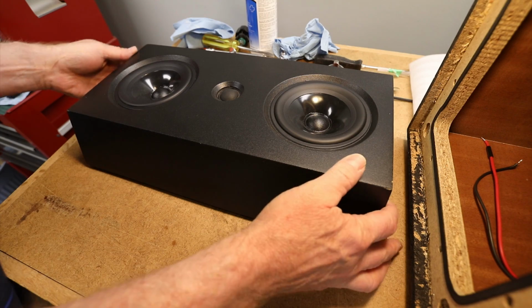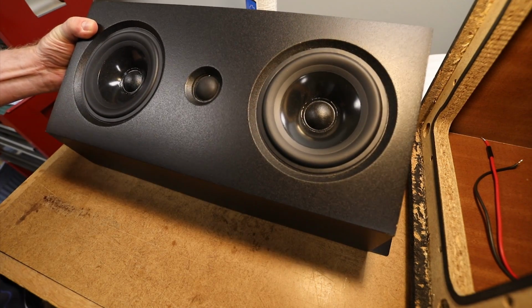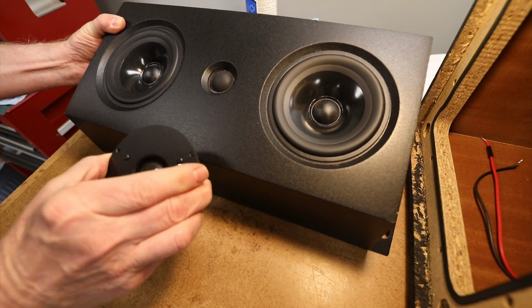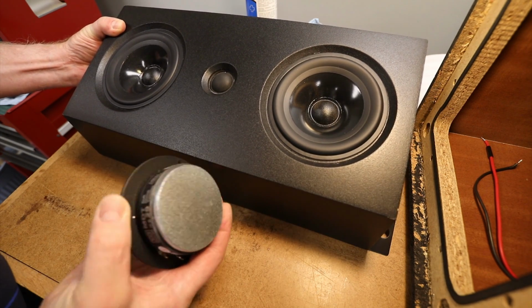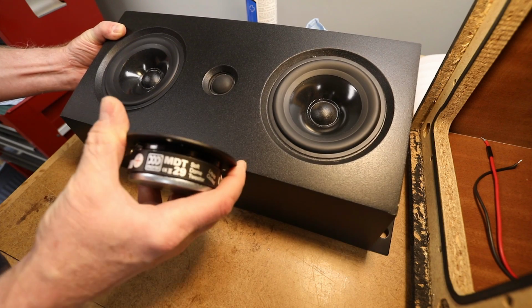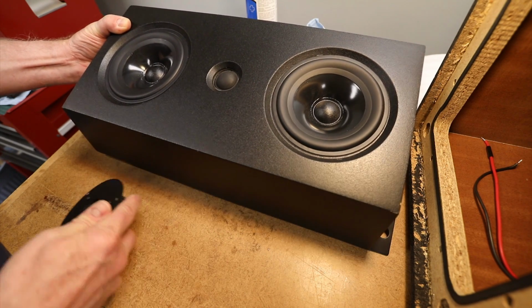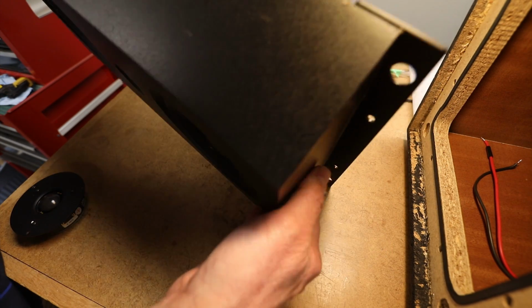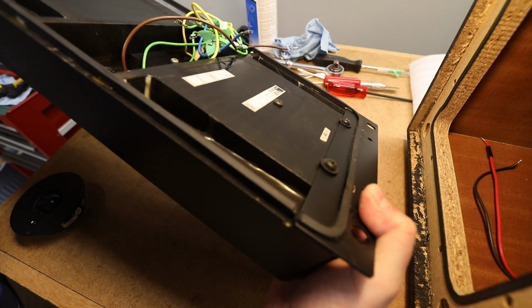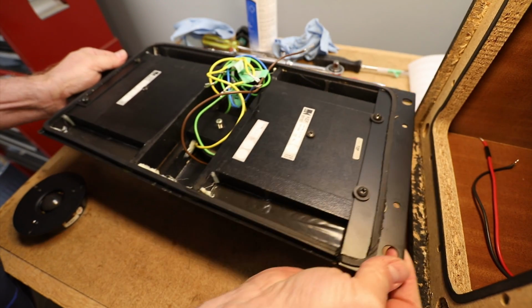The next thing to replace is the tweeter. My husband replaced the original KEF T33 tweeters in 1991 with TS 1191 tweeters. We will be replacing these with Morel MDT 29 4-ohm tweeters. If you are replacing the original KEF tweeters, you will need to do the same simple modifications that my husband did to accommodate the new tweeter.